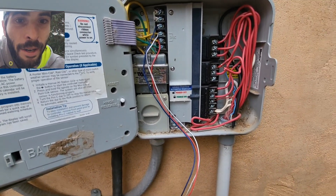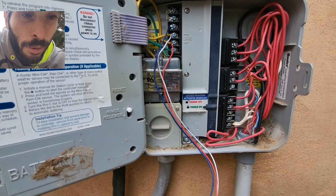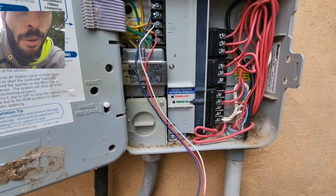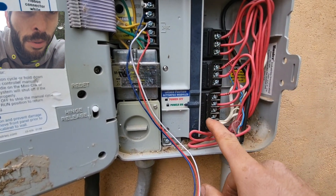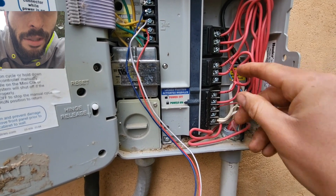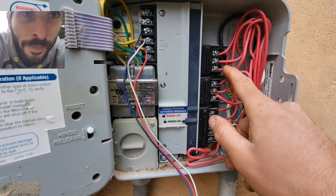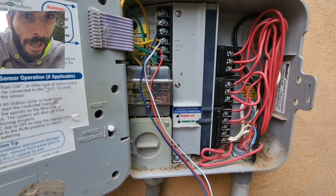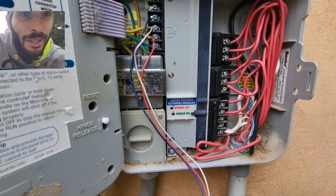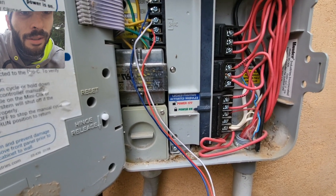So I turned up to this house. It's obviously an old controller — 2008, an old system. You've got your single strand wires. I did a multimeter test and when I tested all my ohms I had three zones showing infinity — zone four, which they already knew about, and then zones seven and eight also showed infinity. I'm not too worried about those because they're in an area where there's a lot of interference, so I'm saving that for the end because finding those valves could be a difficult task.